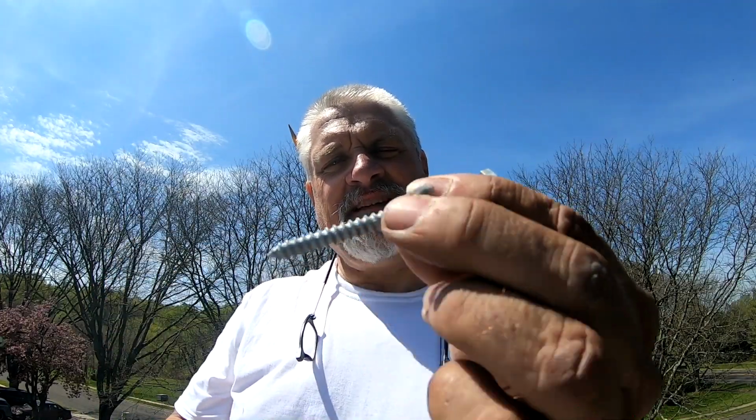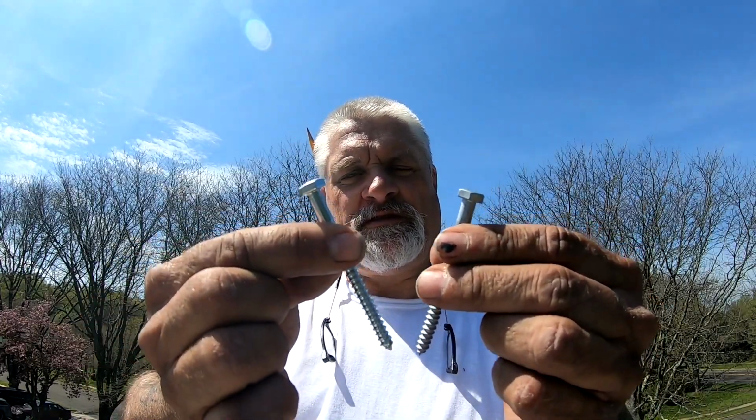So, word of advice, when the customer says, I got all the parts, you don't need to stop for anything, you should anyway. He did have all the parts. He even went as far as trying to put a lot of it together, like the weather vane and stuff. And this is the lag bolt he gave me. Looks good, right? But it snapped off the minute it had some tension behind it. Fortunately, in the truck I had the same size in galvanized, higher grade, so they're stronger than these flimsy ones.